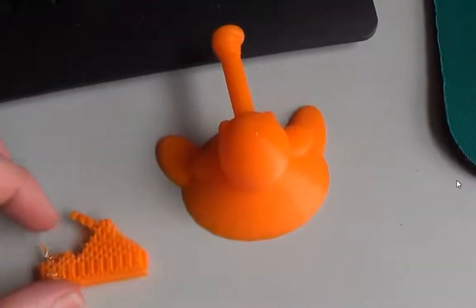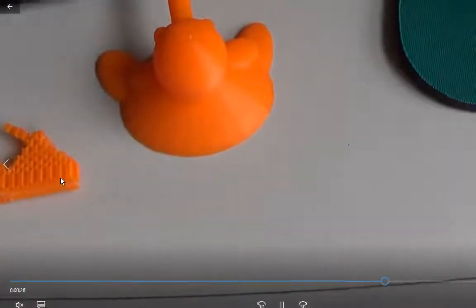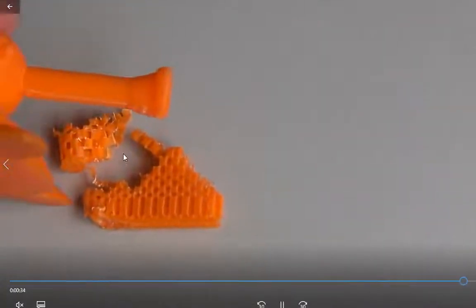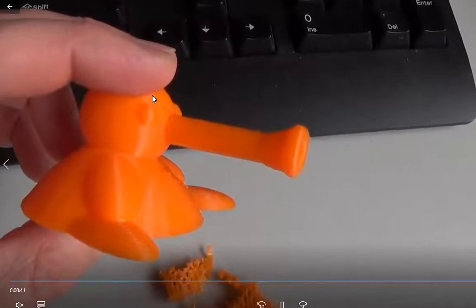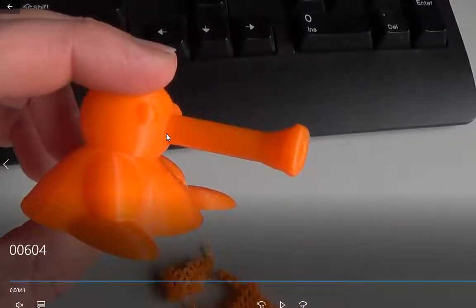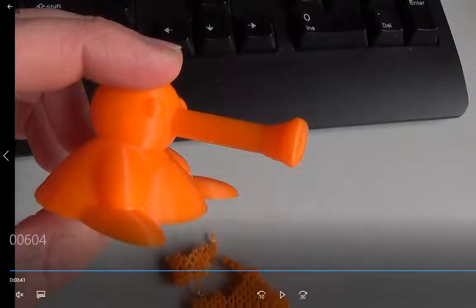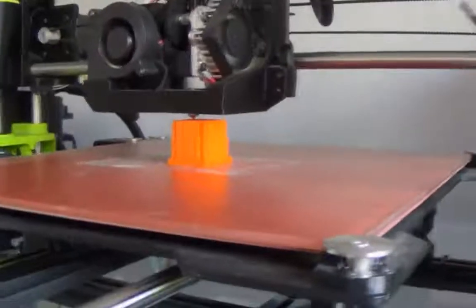I'll probably print a couple more out just so I can keep them as display at the school. That little funny snap piece — that's all the support material I showed you earlier. It sort of snaps off, usually, and the idea is that you snap it off without snapping his nose off. The bond there was strong enough that it held up okay. Every now and again you will snap one off, so your options are to either print again, or super glue works pretty well, or hot glue as well. You can always stick those things back together. But it's best to make a print that is strong where it needs to be strong.